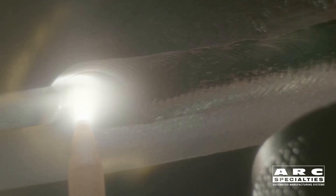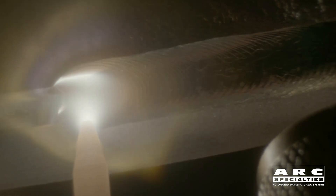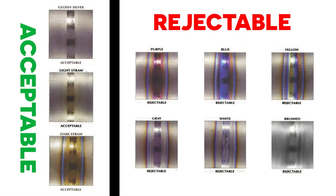Not so long ago, people considered titanium to be only weldable in an inert atmosphere in a glove box because it's so easily oxidized. You can actually quantify the weld quality by the color. Silver is the color that you want — it means no oxidation at all. Straw color means light oxidation; this is generally acceptable. But the blues you see on so much titanium art means excessive oxidation. It could be worse — you could go all the way to grays and even whites. Titanium oxide is white; in fact, it's the pigment in many spray paints, but it's the last thing you want to see in a weld.